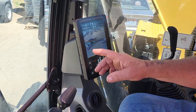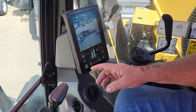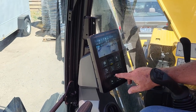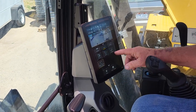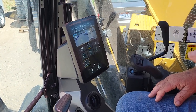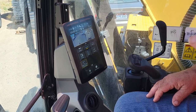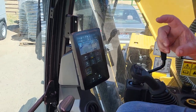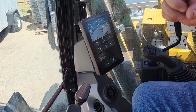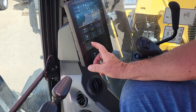How would you measure your bucket? If you're going to calibrate a different bucket, go on down here. Do you have to calibrate every time you get a new attachment? As long as you don't weld — if you weld a board on that bucket and extend it past those teeth, it's going to throw it off that far. So go into bucket work tool settings.